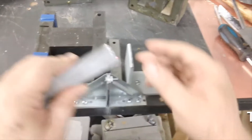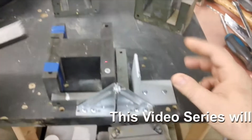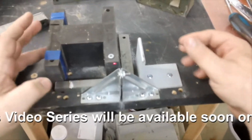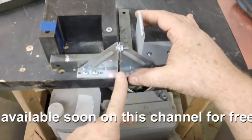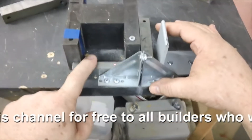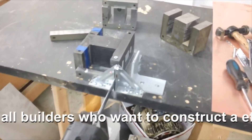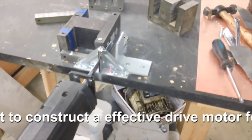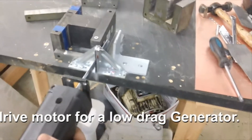The biggest problem here is these plates will separate and you'll have a mess, so you want to keep them together. I just blocked it off and created a small gap using a washer, and this is what I'm going to cut. This is an easy way to do it — it will rest like that and I can almost just rest it on my hand, turn it on and let it cut.